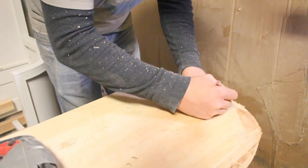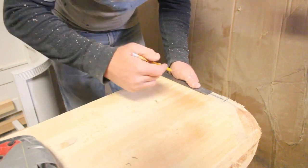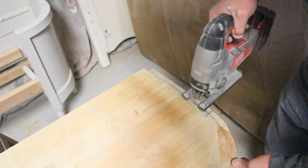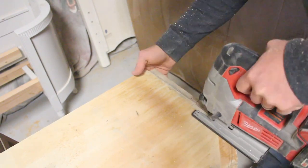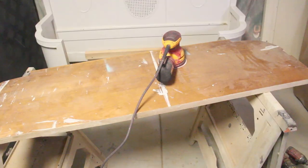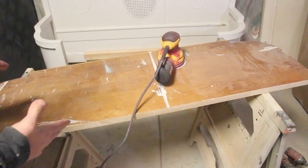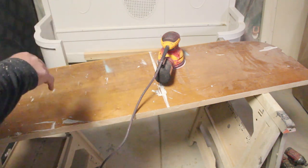The front of that is at nine and a quarter, so it is two inches. So I need to cut from here over and notch that out right there. I feel like the top is pretty close. I have it fitted in there just because sometimes when I fit them in, they don't like to come back out. So if I'm close, I want to make sure that it's all sanded and stained before I drop it down in.